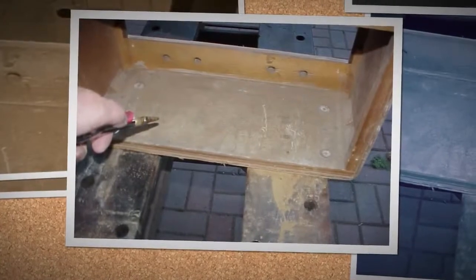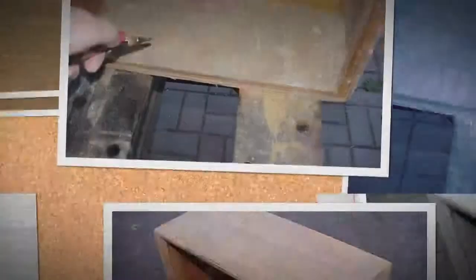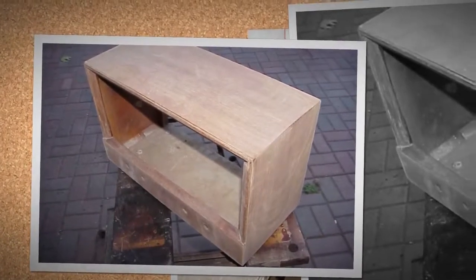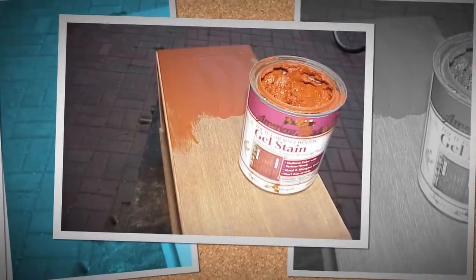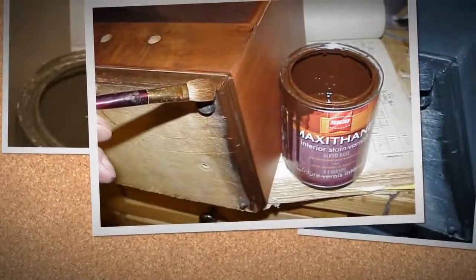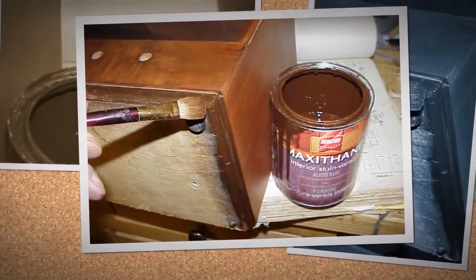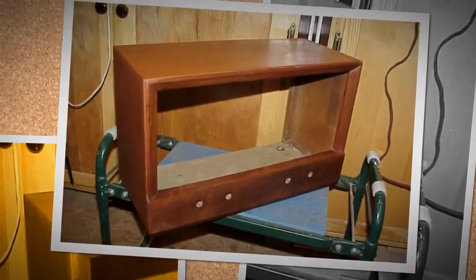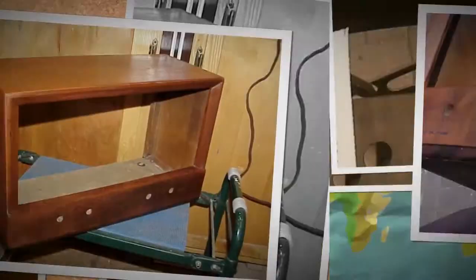The underneath of the chassis is in very good condition. Some work has been done in the past as we can see the hole where the filter capacitor was removed, and underneath we see two tubular filter capacitors as replacements. I prefer not to remove capacitor cans if they cannot be replaced with similar ones, as the look of the radio suffers when something is seen to be missing.